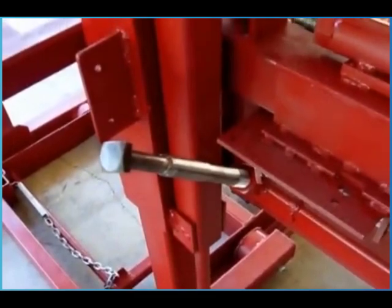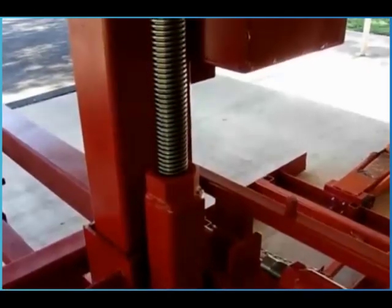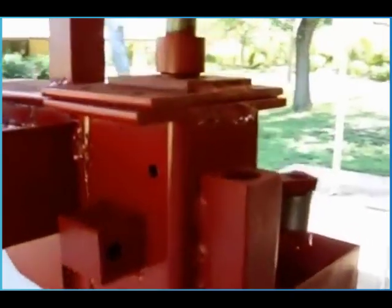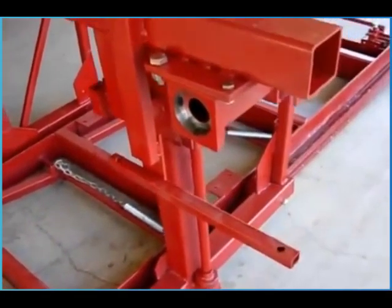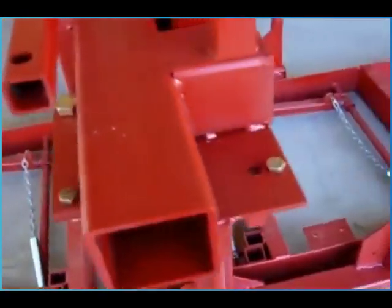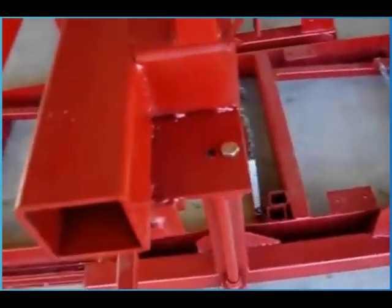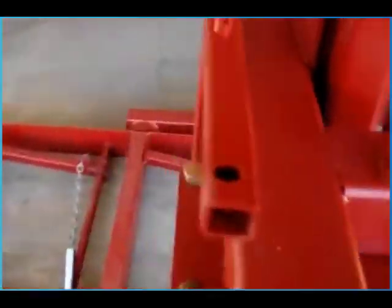The guide I made from 3-inch bar stock. They use ball bearings. The one on the idle side slides in and out; the one on the drive side is fixed. It's real important to get those aligned, so the mechanism allows me to adjust it to be accurate — it's got to be perfectly parallel with your bed. The system is rather simple: I just have a large one-inch bolt that tightens up against the inch-and-a-half tubing, and it keeps it steady.